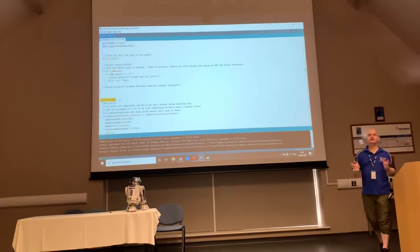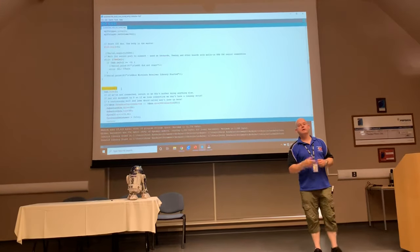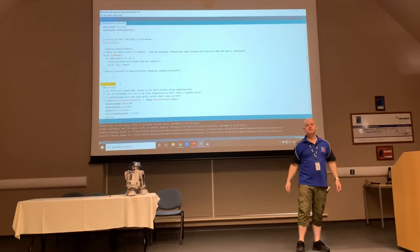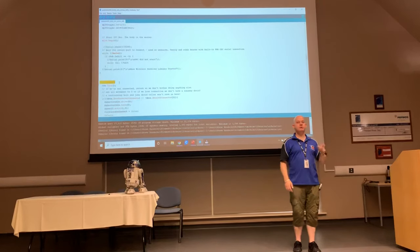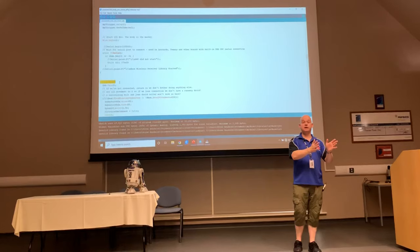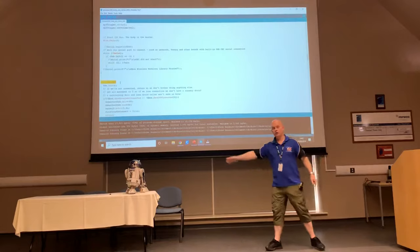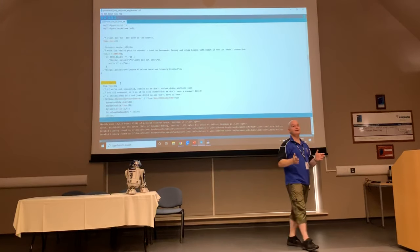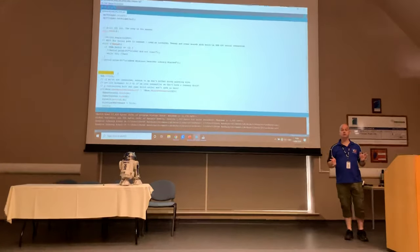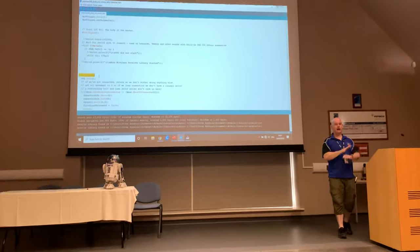It's a little bit, as an analogy, like cooking dinner in the microwave, okay? If you slam the door in your microwave and set it for 5 minutes, putting a delay into your code means you have to stand in front of that microwave for 5 minutes. You can't go and do anything else until that job is finished, okay? So you probably want to say, right, go do that for 5 minutes, I'm going to go off and do something else, in which case you wouldn't use a delay. So be very, very careful with delays. They seem to be a really good solution for things until you actually understand what it's doing. It is stopping your code. It absolutely stops it there.